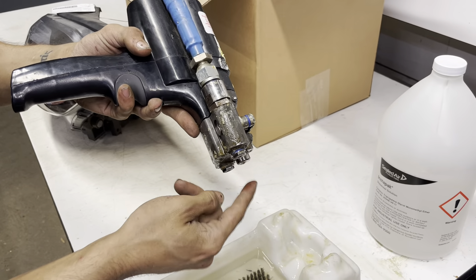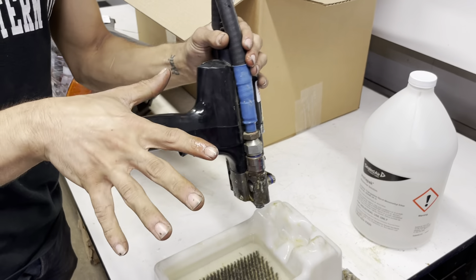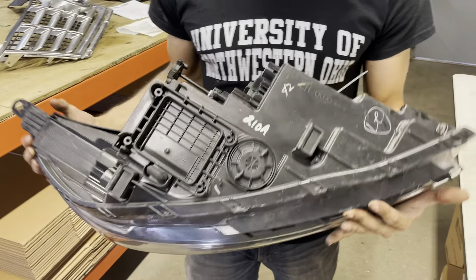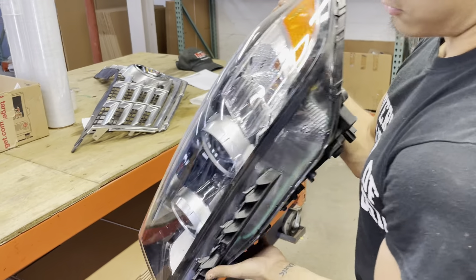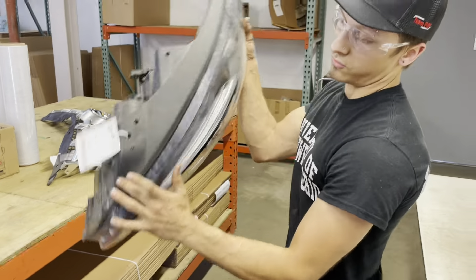You always want to wipe it off before you use it, because if there's stuff on here when you start to spray, the spray pattern will come out uneven. With headlights, we want to make sure everything checks out as part of quality control — look at the headlight itself, examine all the mounting tabs, check the back to see if the ballast is there, and double check all connections. Also watch out for slight cracks or moisture inside the lens, because that would indicate the seal around the headlight is failing, and you're obviously not going to want to send out a failing product.